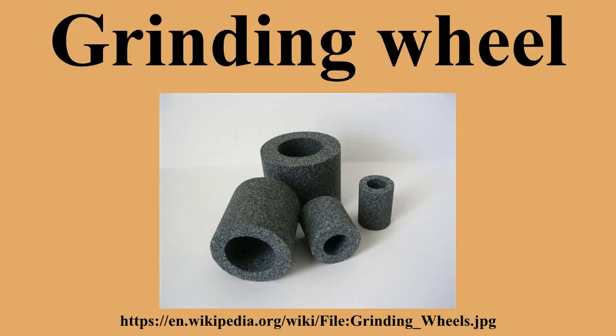Tapered wheel. A straight wheel that tapers outward towards the center of the wheel. This arrangement is stronger than straight wheels and can accept high lateral loads. Tapered face straight wheel is primarily used for grinding thread, gear teeth, etc. Straight cup wheels are an alternative to cup wheels in tool and cutter grinders, where having an additional radial grinding surface is beneficial. Dish cup, a very shallow cup-style grinding wheel.